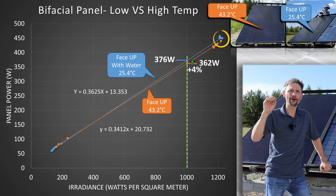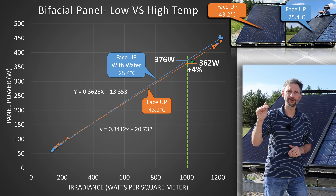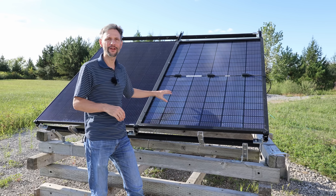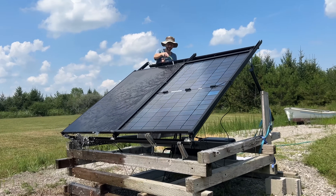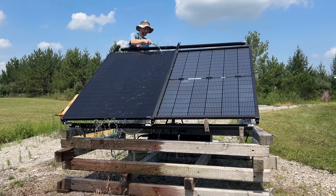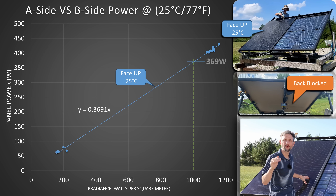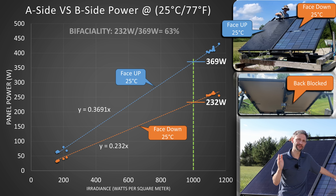The peak measurements that I got were 452 watts. Of course, these are only 400 watt panels, so clearly you can see with the right conditions, you can far exceed that output. And that's without doing anything to boost the backside performance. So now let's check the theoretical max by isolating the front and backside performance. I blocked the backsides with black faced cardboard and kept the panels at about 25 C using water cooling. Adding cardboard to the back side of the panels insulates them and drives the temperature up even more, so controlling both panels to 25 C using water cooling will do a good job of isolating the panel performance from all the other factors. The front only performance was 369 watts or 92% of the rated output, which is really good for one side only output. And the back achieved 232 watts, giving us a bifaciality rating of 63%. The specification is 70% plus or minus 10%, so that's well within tolerance.